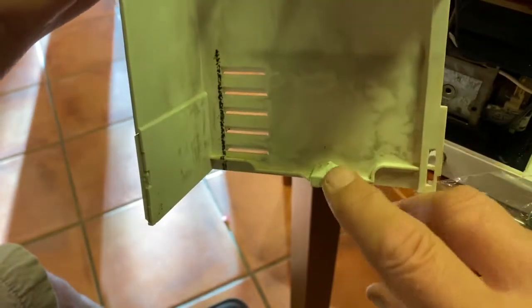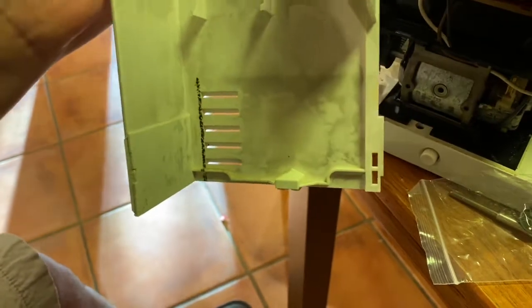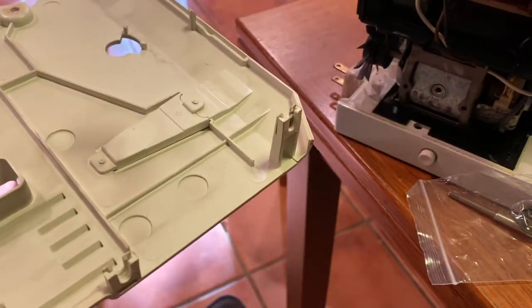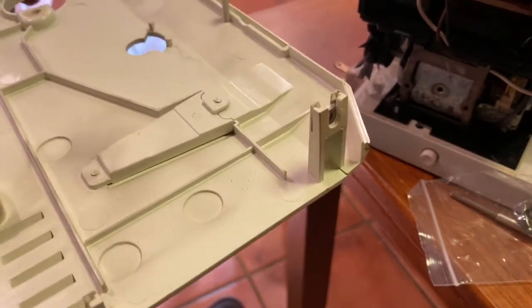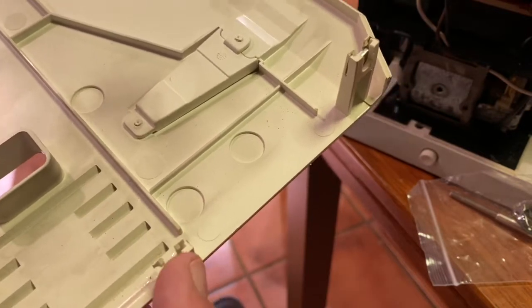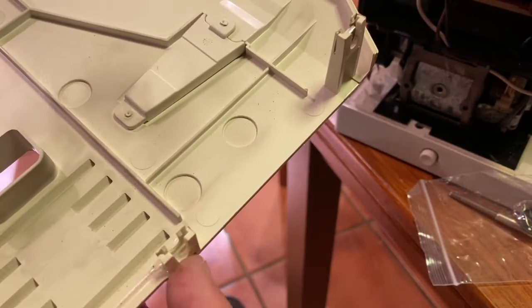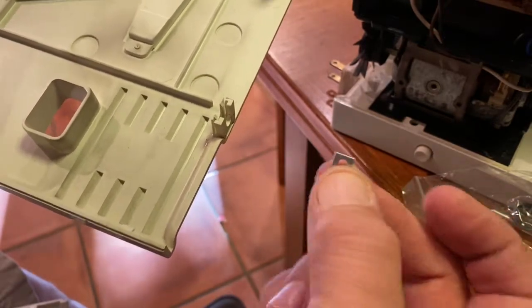You have to be very careful with this cover. There are capture nuts that hide in little recesses on these panels when you remove them. On this machine, this plastic member here was broken — I repaired it with super glue and it's holding fine. You don't want that bottom panel pulling out, and you do not want one of these little M4 capture nuts rolling around on the inside of your machine.